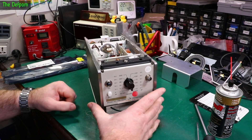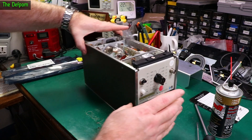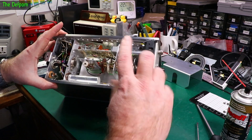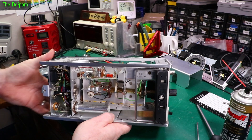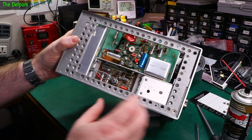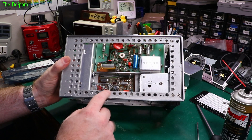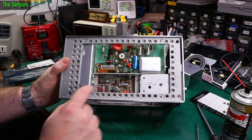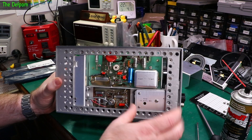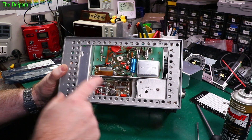It's quite a long time after the last piece of video recorded - I've just been sitting here for a while. So I've pulled it apart now, and I had issues with the switch being a little bit dirty - I've put some DeoxIT Gold in the switch to clean it up a little bit and worked it a bit. This is still an older version with the Nuvister setup in it - I thought that might be gone by now, but it's definitely still in this one. This is 1982. In the 1984 version that's no longer present, so this is right on the end of the Nuvister section. I'm going to go around and check capacitors.